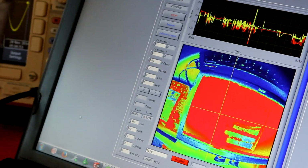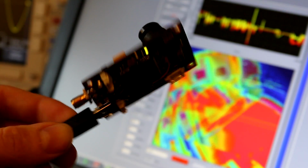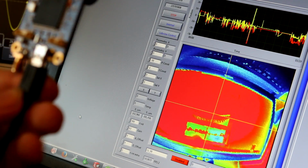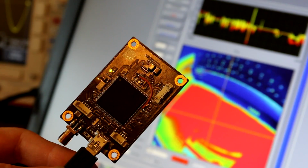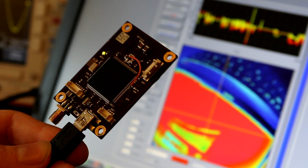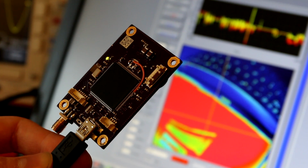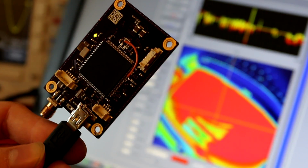As you can see, this is a simple ARM Cortex M4 processor with a small amount of, well, not small, 2 megabytes of SRAM. The processor takes data from the sensor and sends it to SRAM, and from that I'm doing conversion from 10-bit to 8 bits and storing my image inside internal memory. And the DMA controller takes that data and transfers it to a computer.